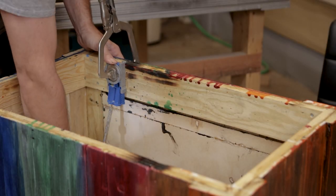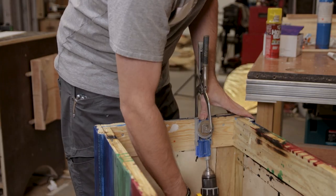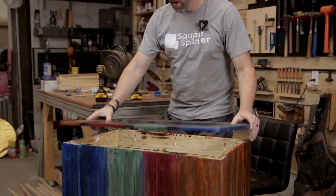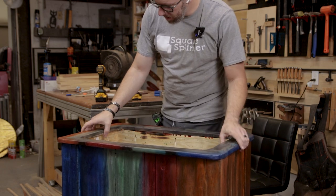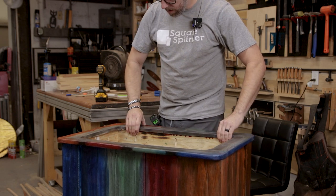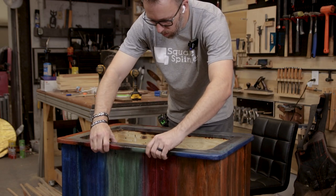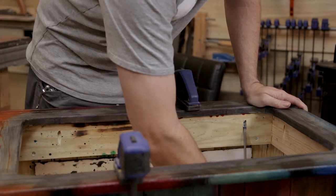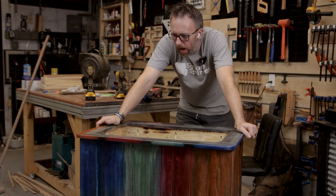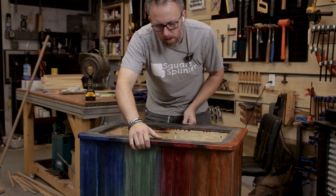The easiest and quickest way to attach the top plate is with your pocket hole jig — it's super fast, makes hidden fasteners, and you can use the weatherproof screws. Pocket holes drilled, check. Now it's time to attach the top, and all we're looking for is to try to get it about centered — not crucial. We know that the cooler is going to fit tightly inside this rim, so as long as there's clearance all the way around, we're good.